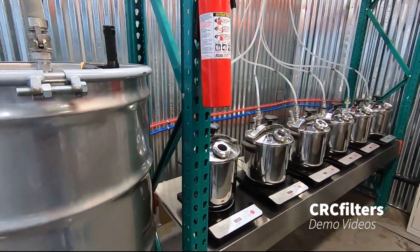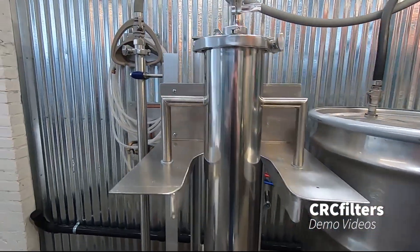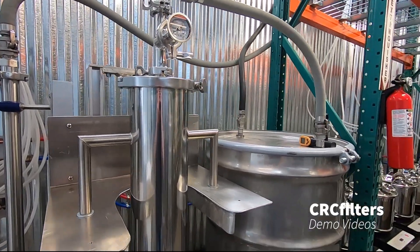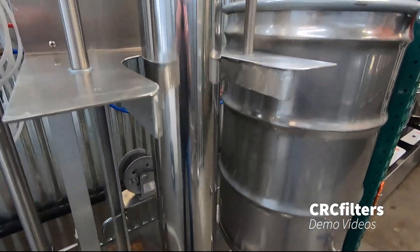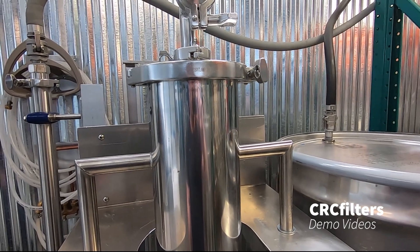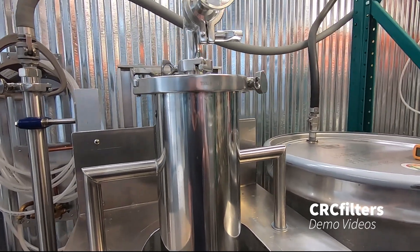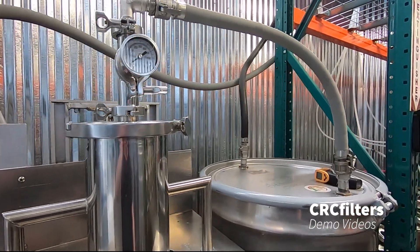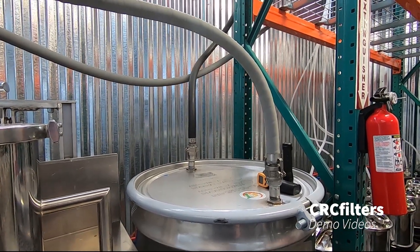What I like to do is connect it directly up to my evaporation system. It's all gravity-fed downflow, so we don't need any pumps, and it's got an upflow through the column — giving your alcohol a long residency time inside that molecular sieve to capture the water. It's really efficient; it gets it down to just fractions of a percent in a single pass.